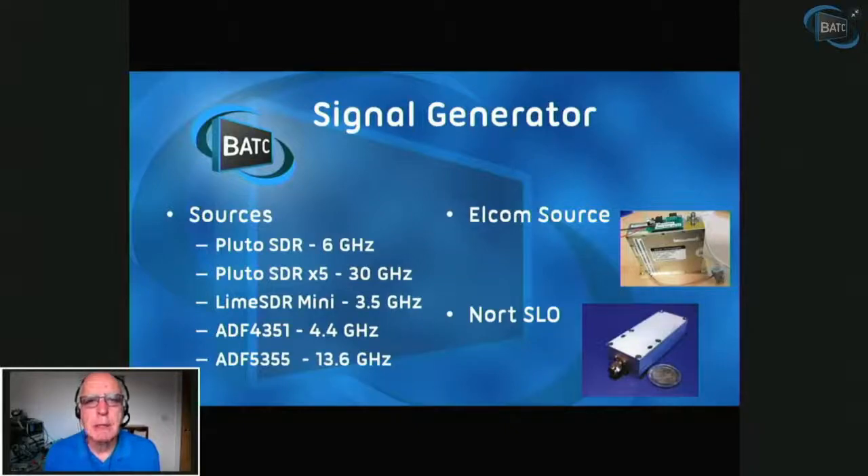The problem with all these SDRs is that they need calibration. Some of you will have come across the calibration spike on the Lime SDR Mini; the Pluto also has a calibration spike, though not as vicious. To get anything out of the signal generator, you do have to calibrate it first: disconnect the output, calibrate, then reconnect. If you then change frequency within about 10%, you don't need to recalibrate. The ADF4351 capability has been retained, and I've added control for an ADF5355 — essentially a grown-up big brother of the ADF4351. In fundamental mode it goes up to 6.8 GHz, and with its onboard frequency doubler, up to 13.6 GHz.